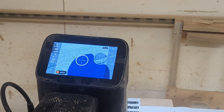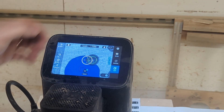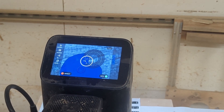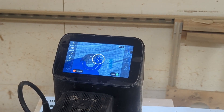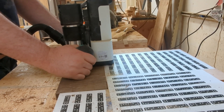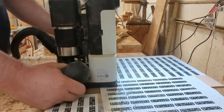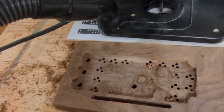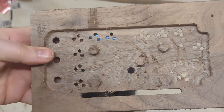I adjust the depth and go deeper, slowly creeping up on the depth I really want. Every time I just expand my hole a little bit. You can see the marching ant line here — I switched the cut to an outside cut and go around the outside. If I miss it, it just fixes it for me. The little dot in the center of the screen isn't exactly in the center of the crosshairs because I was making mistakes, but the router compensates for that. And this is just me milling out the entire thing — and look at that, we have a properly engraved board.